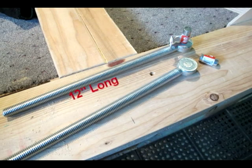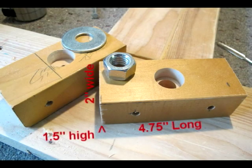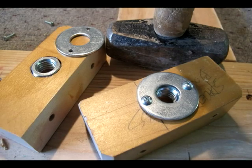Here we see the screw jacks that lift the buggy off the ground, made of 5/8" eye bolts or a similar size threaded bolt. Unfortunately, T-nuts are not available in 5/8" size, so I used a 5/8" nut pressed into blocks of hard maple or a similar hard wood. The nut is hard pressed into a one-inch diameter countersunk hole, one half inch deep — or the depth equal to the thickness of the nut — to keep it from turning when the jack is operated. The nut is then covered with a 5/8" washer screwed down over the top. If desired, epoxy cement or hard wood filler can be applied in the space around the nut, but care should be taken to avoid getting glue on the nut thread or in the hole of the maple block.